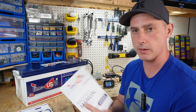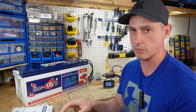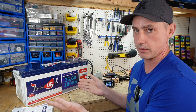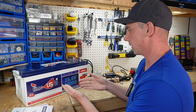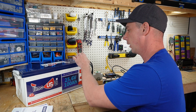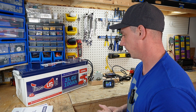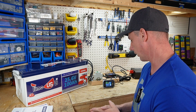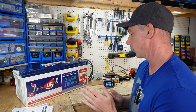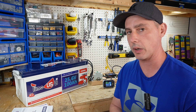That's the product manual — definitely check the parameters page for maximum charging and discharge specs. The battery uses the typical ABS case, the exact same build quality as the 200 amp hour 12 volt battery I reviewed: same epoxy terminals, same graphics. The discharge test is almost complete — we're at 82.4 amp hours and still discharging. I'll leave it and come back once we hit the low voltage disconnect.